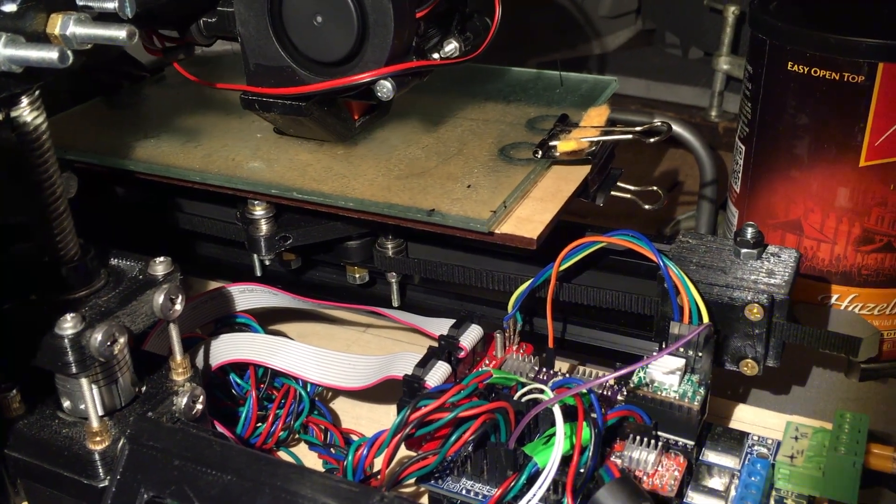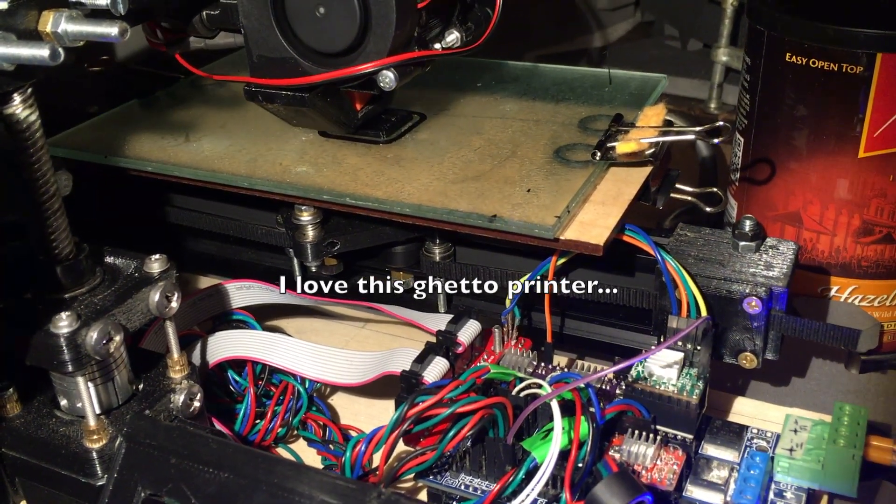All I had to do was plug it in and let her rip. If you have debugging enabled — which you should for at least the first couple of runs — you can pull up something like Pronterface, send an M122 command, and make sure that your stepper drivers are working right. Does it print? Whoo doggy, does it — first try! So that's it. Thanks for checking it out. Hopefully soon I can get back to that music gear video, but in the meantime, like, subscribe, tell your friends about the channel, and check out the links below if you want to support what I'm doing here. Now get out there and make something awesome.